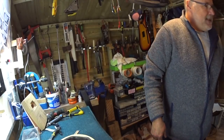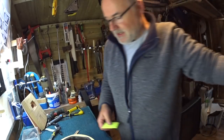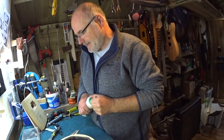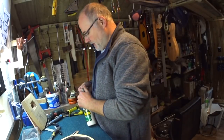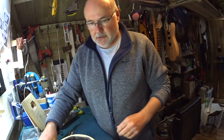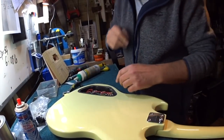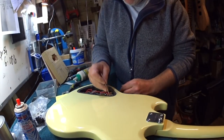I'm going to have to use the old toothpicks and some glue. I suppose I could do a resin fix. That's one way, and you still have to drill. But then you're drilling and fitting into resin. And given that the cavity screws are something that you routinely expect to be off and on regularly, you don't want something hard like resin in there. So it is better that we have some wood.